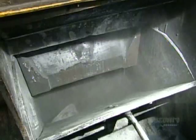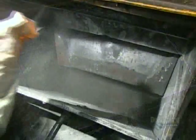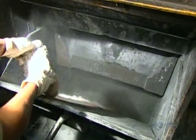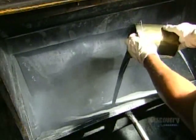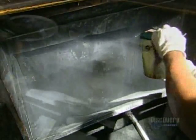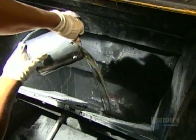Workers feed the ingredients into a preliminary mixer. First the slabs of natural rubber, then antioxidants to lengthen the rubber's lifespan, then one type of oil to help blend in the dry chemicals, then another type to refine the rubber's rigidity level, then additives such as calcium carbonate and sulfur to help cure the rubber during the molding process. And finally, the carbon black filler.